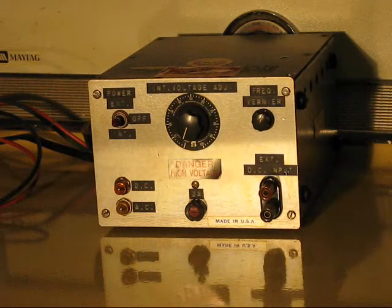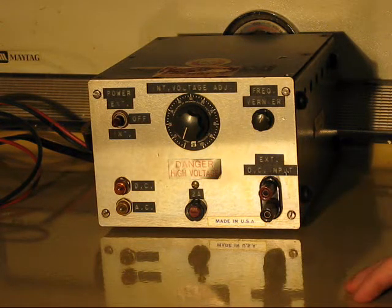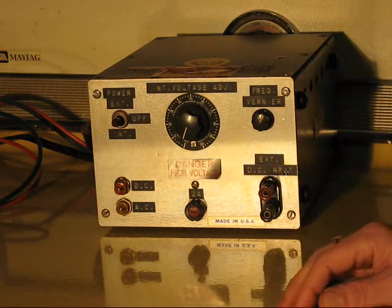Okay. This high voltage power supply is homebrew. Originally I made this to power a helium neon laser. It worked okay for that. I've had a component blow out in it because that's kind of abuse of it, a little too much current drawn from it, from this laser. The laser was, I think, 5 milliwatts. This is actually capable of putting out a little bit more than that.